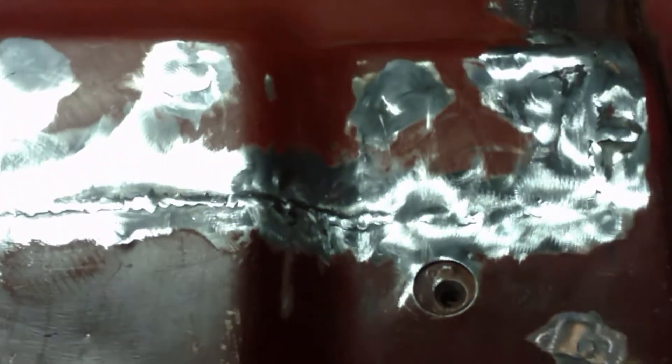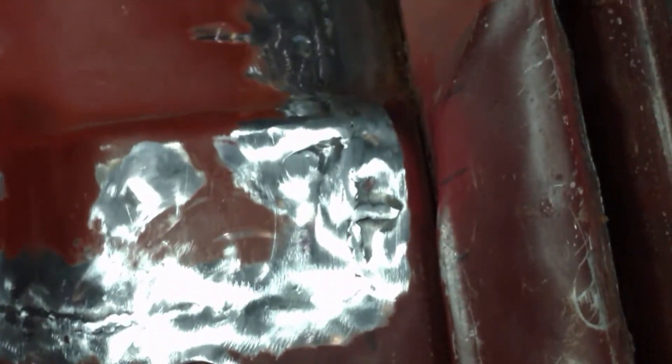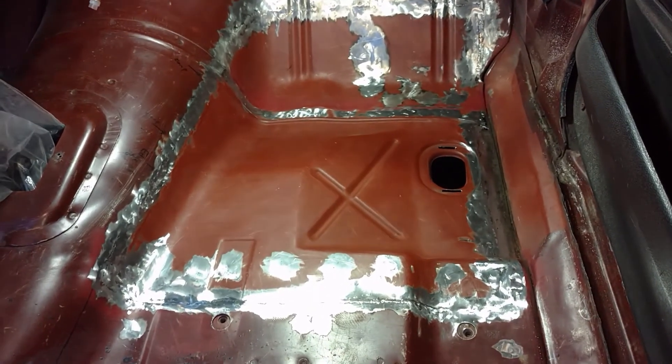You can kind of still see the welds, which I'm not happy about — it means they're sunk a little bit. But I'm not going to try and grind them down because I think I'm actually in pretty good shape for pinholes. I don't think there are going to be that many — I'll put a light on the back side and check, but there are a couple small ones you can see in the relief cut at the back that I'll probably have to fill. This feature turned out actually really well — I cut along that side seam and it looks like it's matched up really well, making kind of the right shape back there as the weld went through. We'll finish up there, and that's where we are.